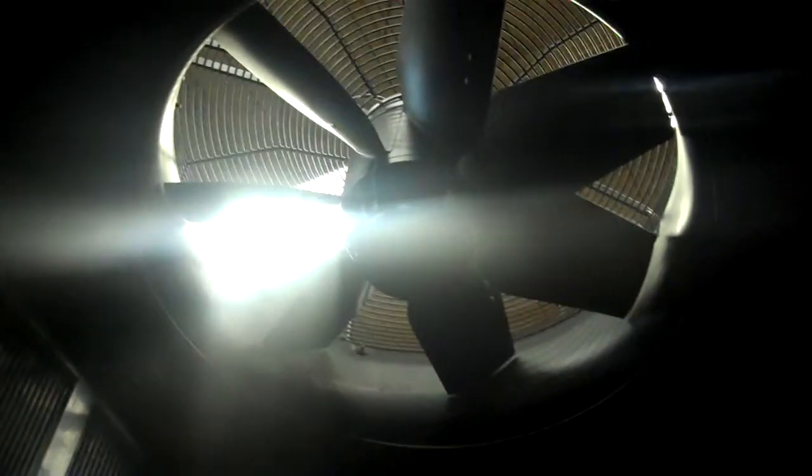There's our process pump, which takes the suction side, goes to the bottom of the reservoir tank there. Our dryer, our sight glass. This particular sight glass, it's tough to see with the lighting, but should show a purple for dry or dark blue, which it does. And here's another view of your heat exchanger and compressor. And looking up, it's got a single, kind of this high-end German coil fan. I forget the German name, but that's part of their NQ series design here.